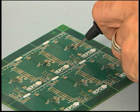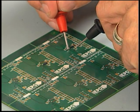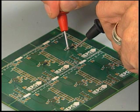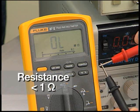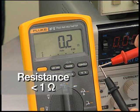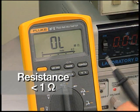Now, with a digital multimeter, measure the gate to source resistance, placing the red positive lead on the gate and the black negative lead on the source. Look for high resistance greater than 100 kilo ohm. If the resistance is less than 1 ohm, it indicates either a bad die or a solder short under the die.